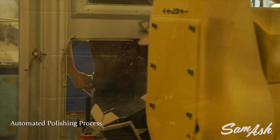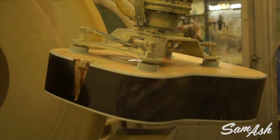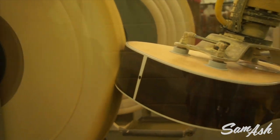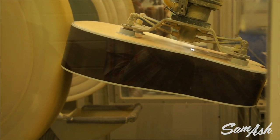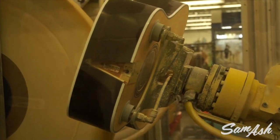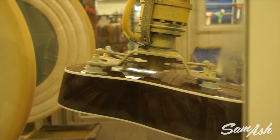We're always looking for technology that will assist us. The problem with polishing is that each polisher would exert different amounts of pressure upon the guitar, and if you apply too much pressure with the polisher, you burn right through the lacquer and require that the guitar be completely refinished — which is expensive and time consuming. This unusual tool, which is actually a combination of two robots, we were a little skeptical thinking that people would not appreciate this because of the handmade reputation of Martin Guitars. But in fact, this has become the most popular part of the tour. There's a rough wheel and then a fine wheel. Lacquer forms what we call peanut shell or orange peel, and that's what we need to remove. We still have a lot of hand polishing to do after this, but this does the bulk of the rough polish.